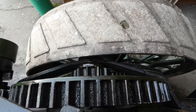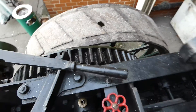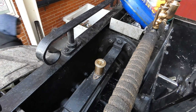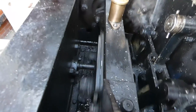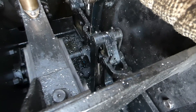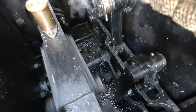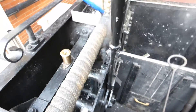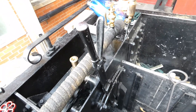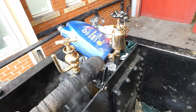Looking over at the gears, you've got the main road gears — this is a single speed engine. That's looking back towards the cylinder, cross head slides at the top, an oiler, and you've got the cross head going backwards and forwards. You've got the valve rod at the far end, the rod coming off that to the lifting link and the expansion link — I'll look at those in a further video.